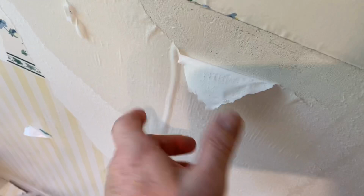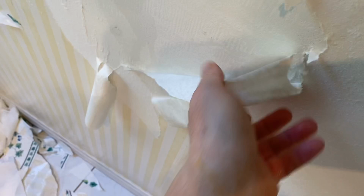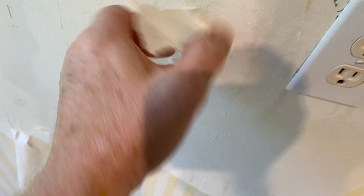Now, after you remove the junky wallpaper, this is what you have left. You want to be real nice to this stuff. Oh, so gentle. Look. Okay, once you get that exposed, now you see where it didn't come off? Why is that? Because it's not wet. Please, follow my instructions and learn from all my mistakes. Wet it. And when it comes down hard, wet it again. Okay? I'm trying to show you so that you can learn how not to...